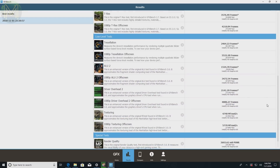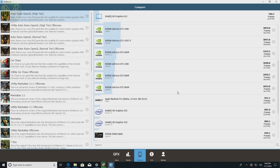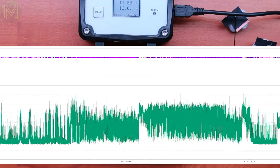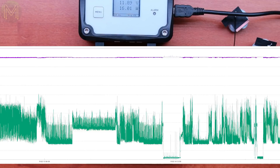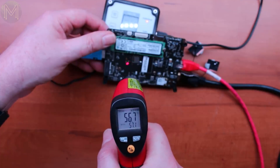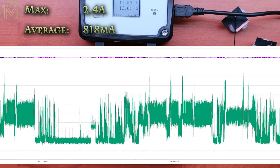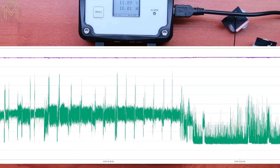The final FPS scores were decent enough — with the lowest being 12 FPS and the highest 64 FPS. Not surprisingly, this places it alongside an Apple MacBook Pro, which runs the same CPU as the Alpha. During the tests I logged both power and temperature. With an ambient room temperature of 33°C, the max temperature I saw was 86°C, with an average of 68 and a minimum of 58. Externally I was measuring a max of 52.7°C on top and 57.1°C near the CPU underneath. On the power side it drew a max of 2.4 amps, an average of 818 milliamps, and a minimum of 40 milliamps at 12 volts — similar to the Nano PC-T4, so not a low power SBC at all.